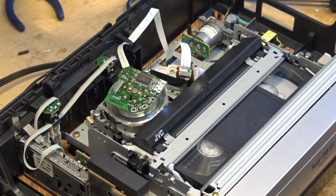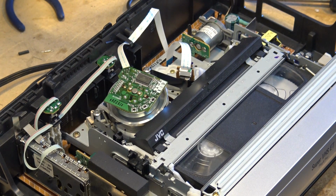So I'll stop it, press the SP EP speed button, and then hit record again. And again it'll record a bit, and then back up. So now it's going to back up. Plays it back, and then goes into record. Actually, I think it plays it back while it's backing up, is what it does. It makes a short recording, and then it goes into playback, and it plays it back as the tape is reversing, and that's where it calibrates. And then it goes into record mode.